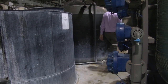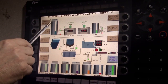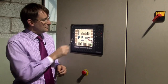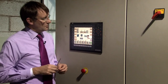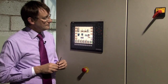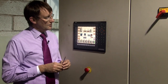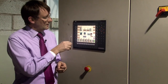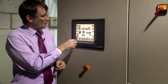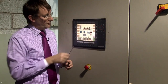Here we are in our water treatment plant. Over 50% of our water is recycled through an ion exchange system. This is the main control unit for the plant — at the moment we have 6,300 litres in there. The first part of the process is to increase the pH, which is quite low at this stage: 2.7. The second part increases it further to a minimum of 6. From here we add an inline flocculant agent, which grabs onto the solids in the water and makes it heavier so we can pump the water into a settlement tank, whereby the solids drop to the bottom and the water cascades over into a V-notched tank, which is then relatively clean and able to go through to sewerage.